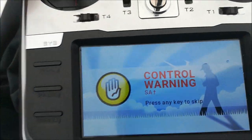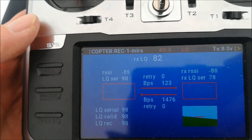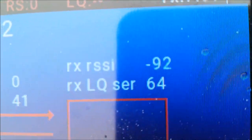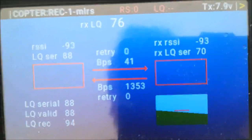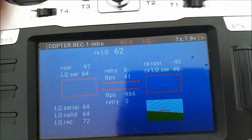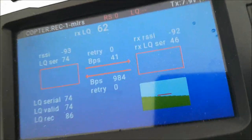There are some switches — you know this game. Oh wow, this was fast. Impressive. Unbelievable. We have a link quality for the RC data of 80. We have a link quality for the CL data of 60, where RSSI is 90. So we actually have a very good CL connection — we get quite all of the bytes through. I'd say this is an excellent connection, given the simplicity of the system so far. That's very cool.